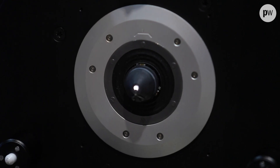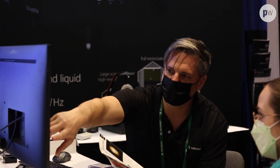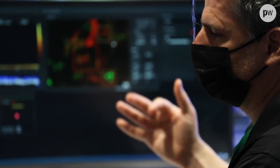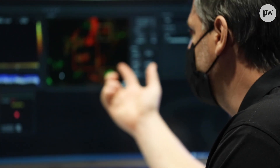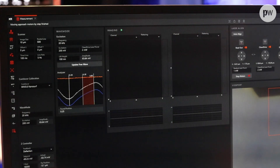You can see the resonance in air or in liquid without any crosstalk with other resonances in the system. We've also launched a new mode called wave mode, which is a type of off-resonance tapping. Typically in tapping mode you run the AFM almost at resonance or just off resonance, but wave mode runs well below the resonance of the cantilever, and we use the photothermal effect to drive that off-resonance tapping.